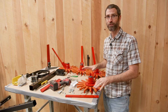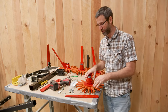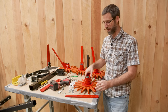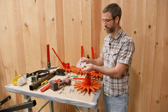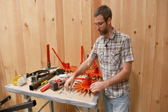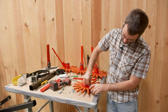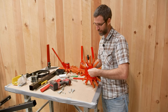The next step is assembling the finger weeders — the last final step to this A-blade finger weeder setup. When you get the finger weeder, it comes in three or four pieces: the drive plate which goes on the bottom, the finger in the middle, the hub that gets added on top, and the shank that gets bolted on. With each finger weeder, a pack of bolts and nuts comes with it along with instructions. The first four bolts are smaller carriage bolts — carriage head on top going down through, lining up all the holes, then adding the nuts on the bottom. Put all four in and tighten at the same time.